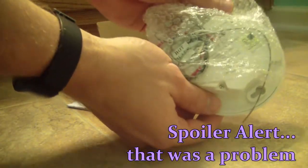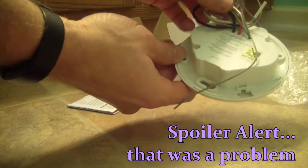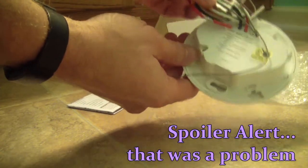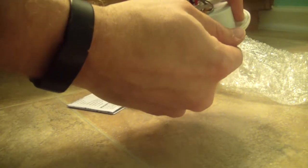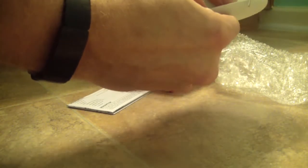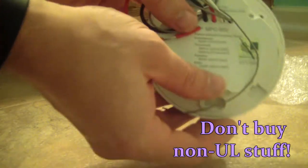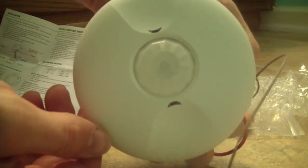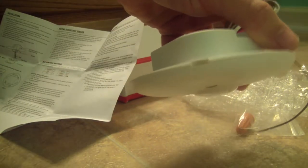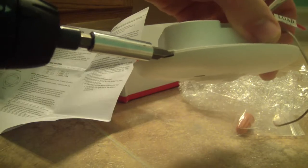This can fit on a ceiling electrical box. It does look like that's the case — you slide the pieces in, and this is able to pop out and rotate once it's wired in. The UL sticker is on there. To access the settings, you take a flat blade screwdriver, fit it into that little tab, wiggle back and forth, and it pops out.